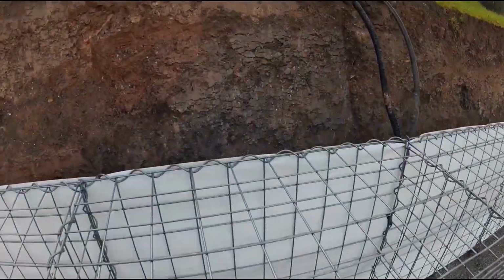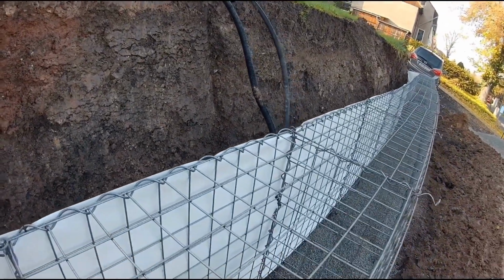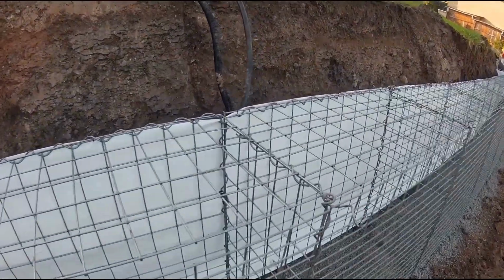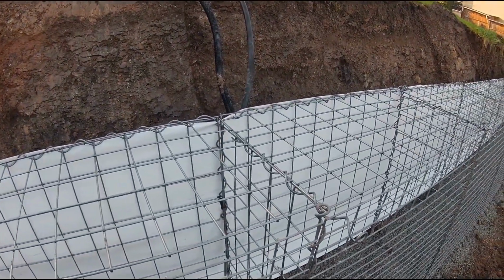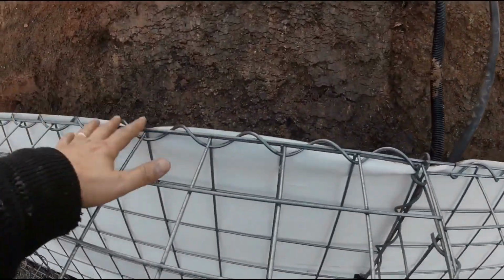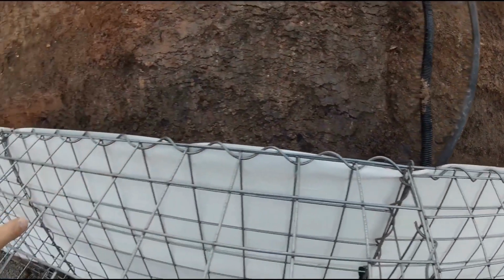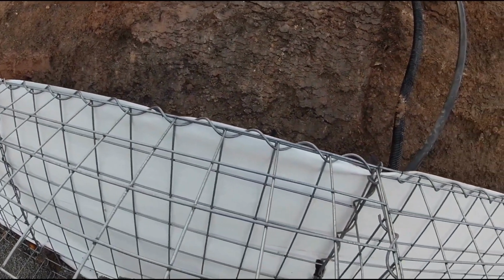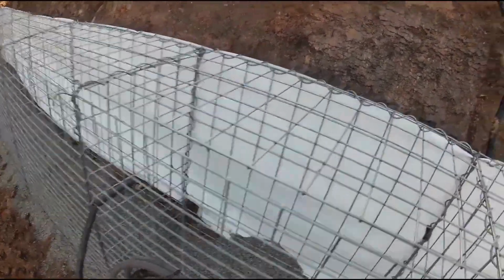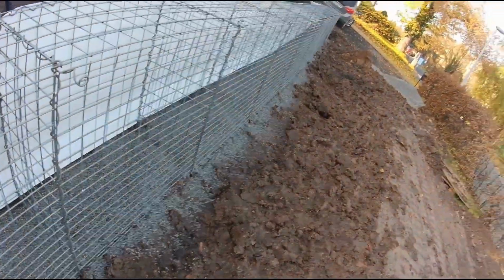When I fill the earth from the back, I have to do it carefully. Maybe I will add a little more sand beforehand to protect the empty pipes. The empty pipes must be tight so that I can later pull the cables through without any issues. I do not lay a 90-degree bend with the empty pipe corners. To make it easier to pull the cables later, I carefully create a smooth curve. This way the cables are organized and accessible, facilitating future adjustments or maintenance.